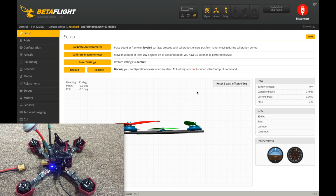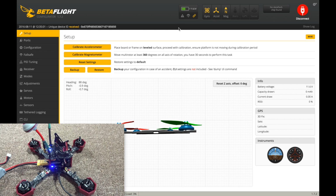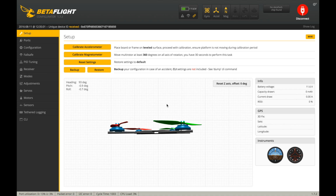We're now in Betaflight, so you can see this is awesome. So let's plug our battery back in here. You can see everything is working, and you can't use this Betaflight configurator if you are not on at least 2.9.0 or later, or else some of the functions don't work and it's just not stable and supported. So make sure if you're going to use the configurator, which is awesome because it has some different features, make sure you're on Betaflight 2.9.0 or greater.